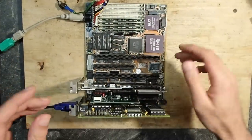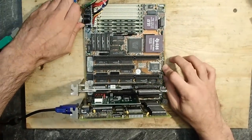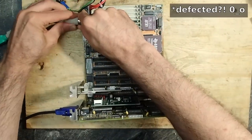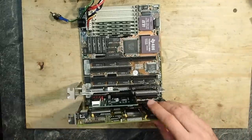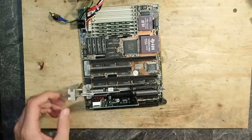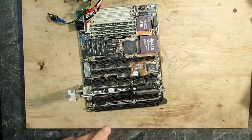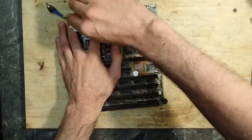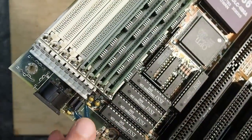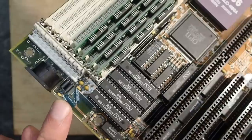Now let's summarize. This board suffered from some sneaky battery damage. One cache IC was defective. I ended up with two ICs from 9342 and two from 9340. I could change only one, but I decided to stay in pairs for no obvious reason. The corrosion has been fixed. I restored some traces using a thin wire and covered the spots with some nail varnish.